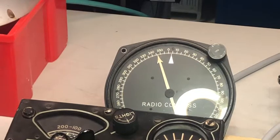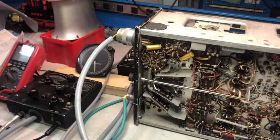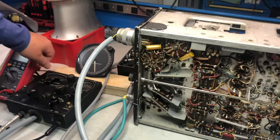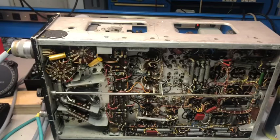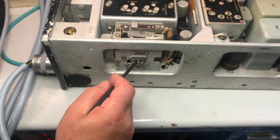Let me move the test setup onto the receiver. I've switched on the DC power supply and removed the control wire from the inverter. As expected, if I switch the band switch the motor rotates — and I've discovered that the relay that was chattering is actually what causes the motor to rotate — but again range number one doesn't work. Let's see if I can figure out what is happening in the receiver.